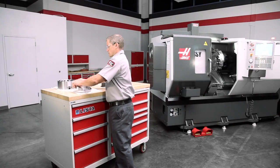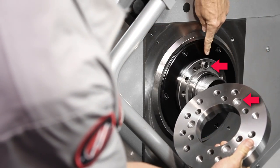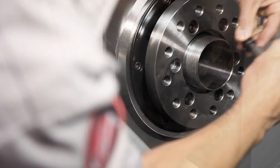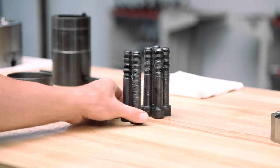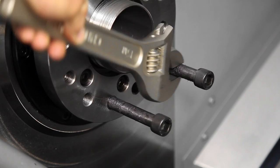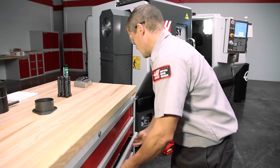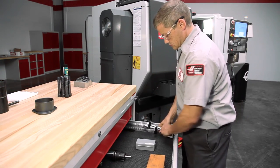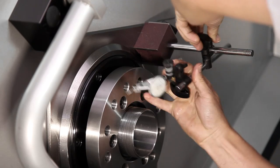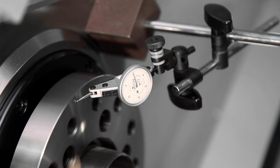Now let's get back to finishing the 10-inch power chuck install. Mount the adapter plate on the spindle face, aligning the spindle's locating dog to one of the recessed holes on the adapter plate. Andrew inserts the six connecting screws and also two of the chuck mounting screws — along with the large wrench, these will keep the spindle from rotating. Torque the screws to the value recommended in the manual that came with your chuck. If you think there might still be contamination or something cocking the adapter plate, attach an indicator to the spindle bulkhead and check the face run-out of the adapter plate. The run-out should be less than five ten-thousandths at the edge of the adapter plate.